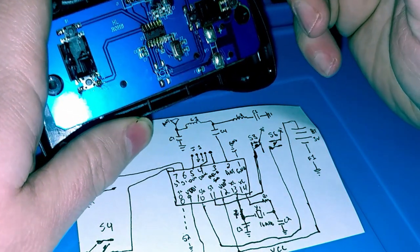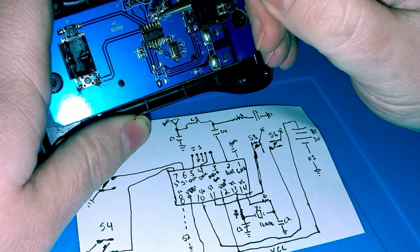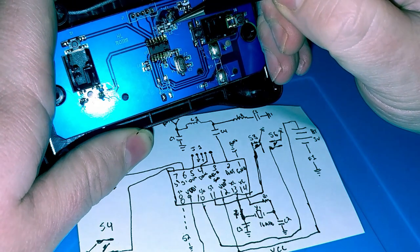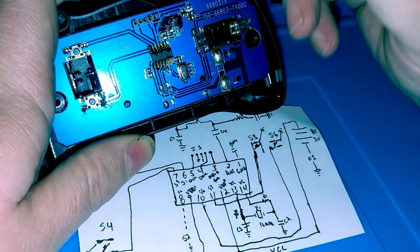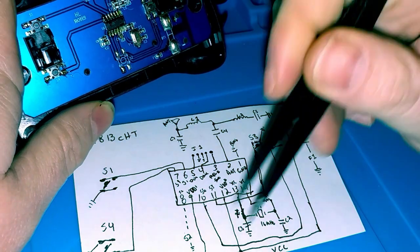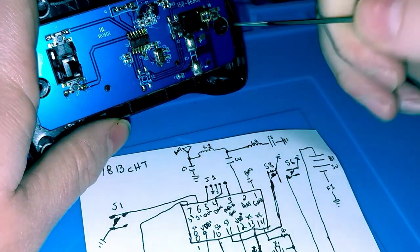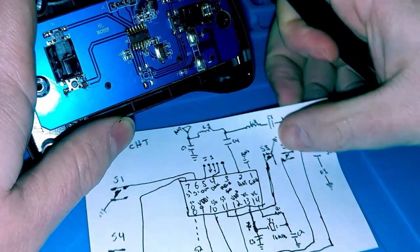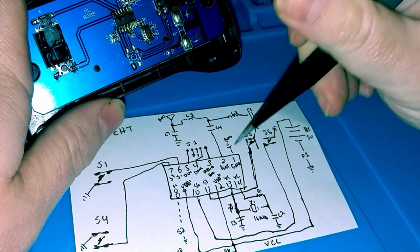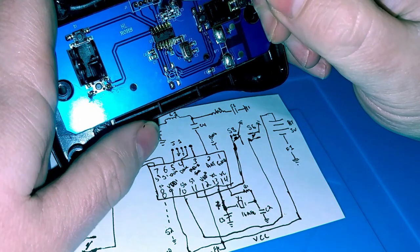So what you have, let's see, that's where the voltage came in. Alright, antenna output, I'll go over that for a second. Your antenna out is over here on pin 2. You have a series of inductors and capacitors providing an RF choke, for noise suppression, since you have voltage and you're generating an RF 2.4 gigahertz signal. Keep your voltages off of that RF signal. You have ground here on pin 1. Again, ground in reference to the negative terminal of the battery.